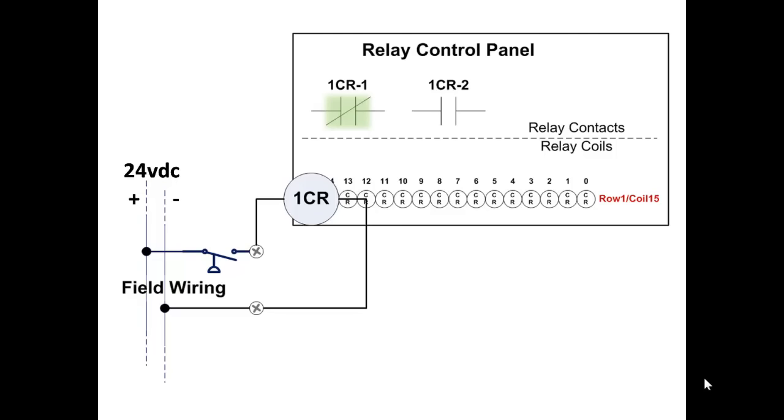However, the contacts mechanically connected to these relay coils do not exist in the scheme of things unless you use them. That is, the contacts are wired into other circuits that control other relays or the control output devices such as motor starters, panel indicators, solenoid valves, etc. This is why we separate the coils from the contacts logically in our diagram. Okay,